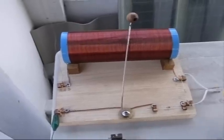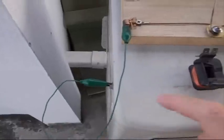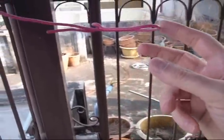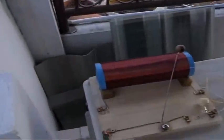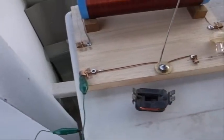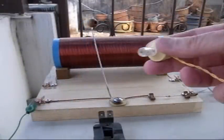Here it is in use. Got an earphone over here on this side, connected up. For a ground, I've connected to an air conditioner. The antenna wire goes up here to an insulator and then all the way out to that fence, connected by a piece of string to keep it from touching the metal. Be careful not to run it near electrical lines — make sure your ground has nothing to do with electricity; use something like a water pipe. For operation, that's pretty much it — just listen and tune. So does it really work? Have a listen.